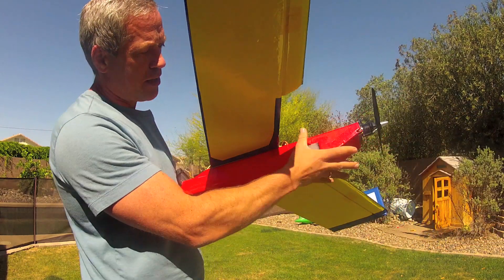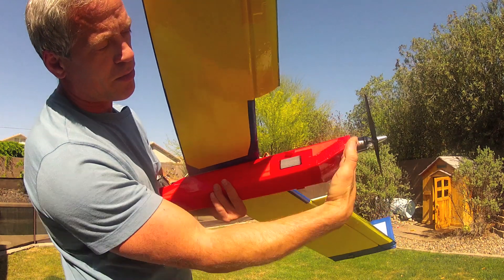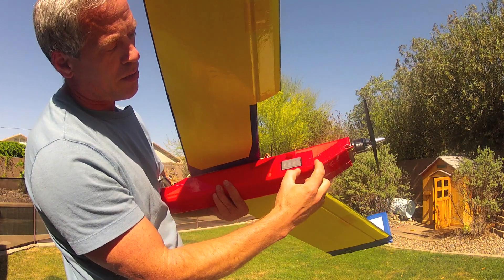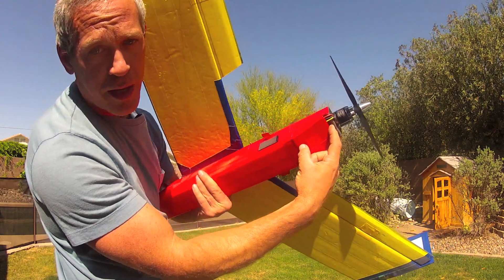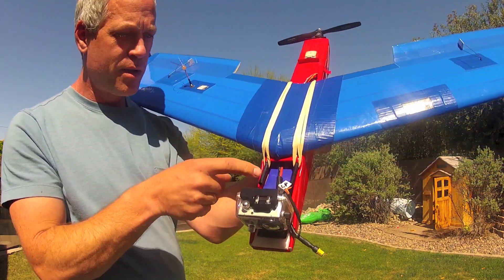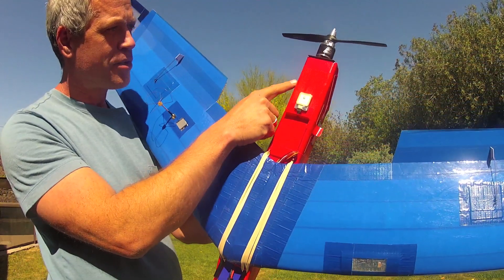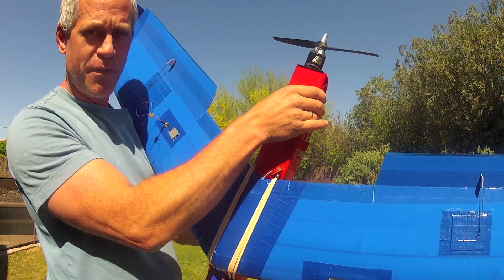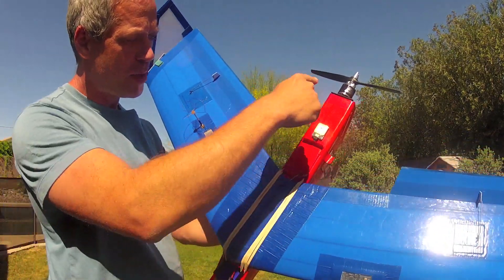In order to preserve the square cross section of the rear fuselage, I did ramp this slightly more acutely, and that created a narrower space here, so I moved the speed controller from the bottom to the side. For the wing tie-downs, I used carbon arrow shafts here and here, which protrude through the fuselage all the way back to the reinforced foam board motor mount, and so they provide a structural component the entire length of the plane.